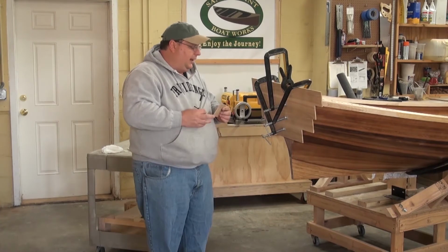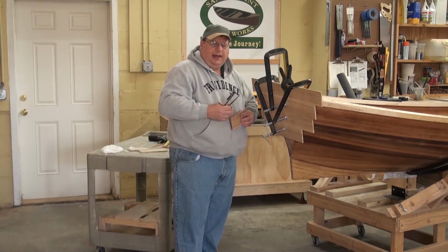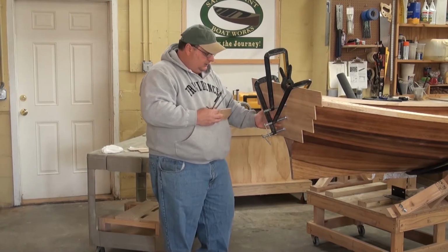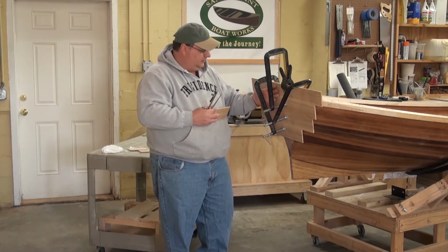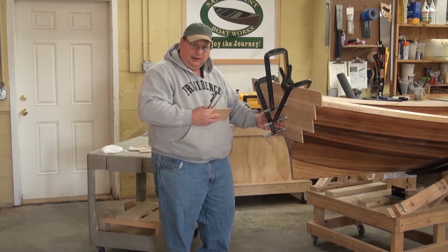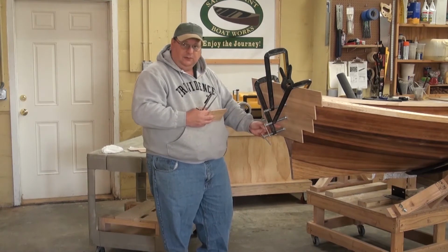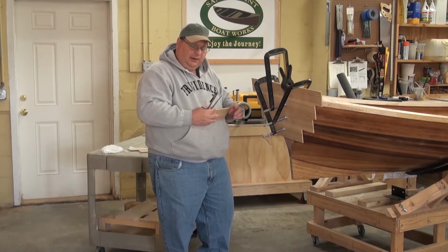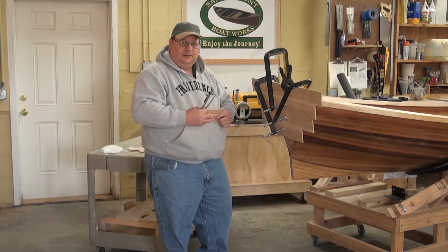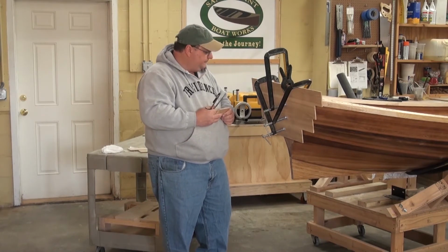If you do that, ultimately what's going to happen is I'm going to back the screws out, counterbore that, and put bungs in there, wooden bungs. Now, you may choose to do some accents and offsets. This is going to be certainly not as dark as mahogany, but a little bit darker than the seats. You could take mahogany bungs or the purple heart that we used already in the boat, put purple heart bungs going down the sides here. Or you may choose to hide it as much as possible and make bungs right out of the ash.